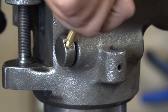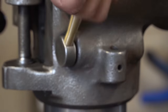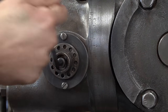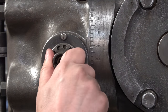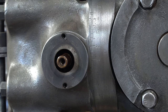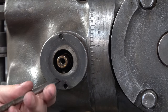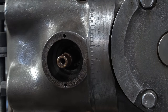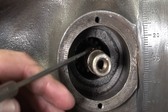You can see why I needed that not-flared, tapered base — now it's not long enough to interfere with any other part of the mill. When I purchased this mill, I was informed that the quill spring was broken, which is why the quill didn't really function like it's supposed to since I've owned it. It's not the end of the world — you have to kind of hand feed it yourself. But not only is it broken, it actually doesn't exist. So that's great.